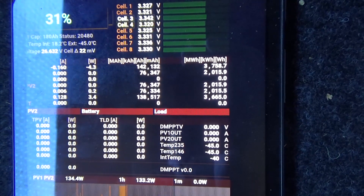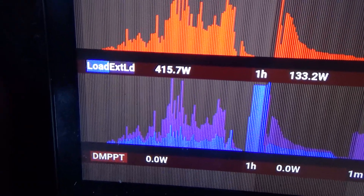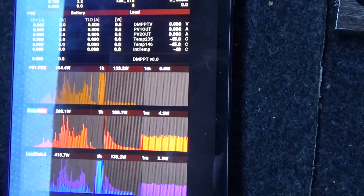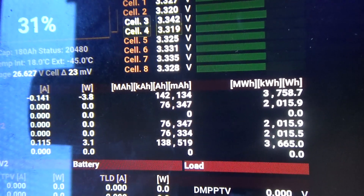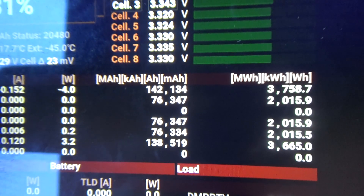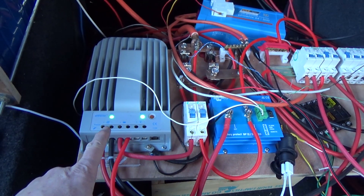It's been another week of terrible weather, though quite nice today where we got a peak of just over 400 watts out of our 750 watts of panels. Over that time the MPPT controller with two panels in series has put in 142 amp hours, whilst the single panel through the DSSR20 has sent in 76. So this time the DSSR20 has slightly edged out the MPPT charge controller.